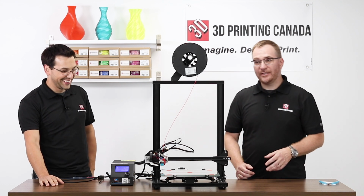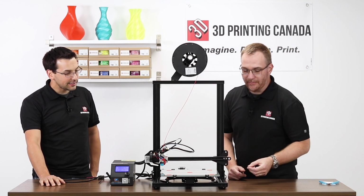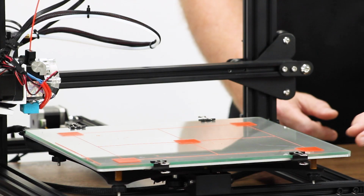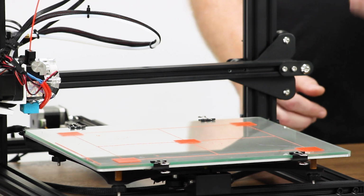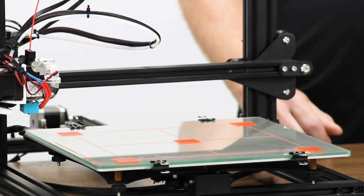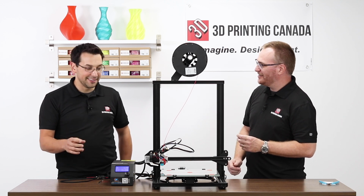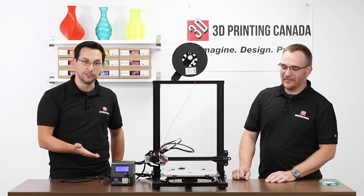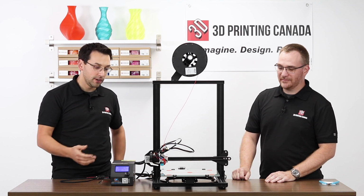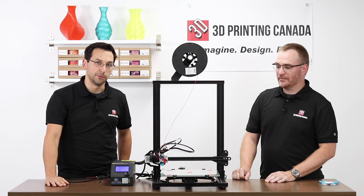Thank you. And during the print, if you see that the material doesn't stick very well, you can adjust slightly the screw under the bed, but just maybe a 16th of a turn. Yeah, exactly. Lefty loosey, righty tighty. You've got to remember which orientation to turn it to bring the bed up versus down. It's especially confusing when you're reaching around from behind the printer. A little easier when you're standing in front.